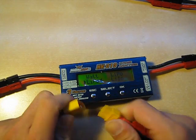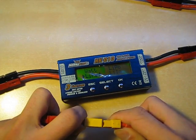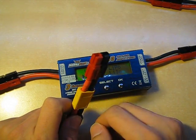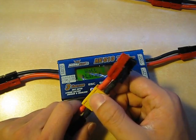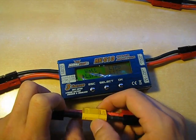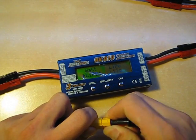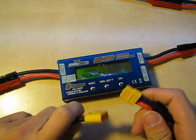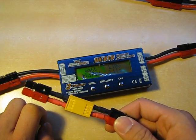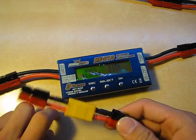You have greater grip surface and compatibility with other connector types like 3.5mm bullet connectors. The connectors even feature a little recess for the heat shrink to slip into before you apply heat, so you don't have exposed bits of metal like with Dean's. This is real nylon plastic — not the cheap polyethylene you find with knockoff Dean's connectors. Because manufacturers save on patent royalties, they can bring you a better connector for cheaper. It comes with these XT60 connectors — as the name implies, rated to 60 amps — not the power poles.